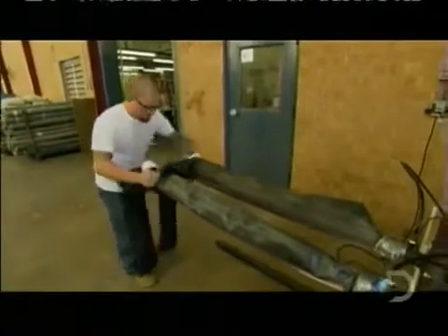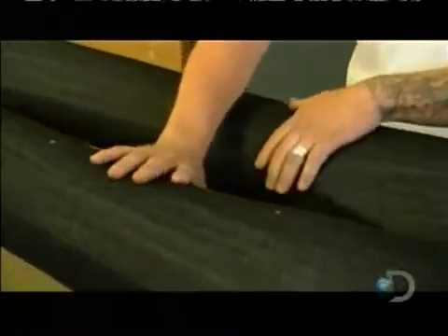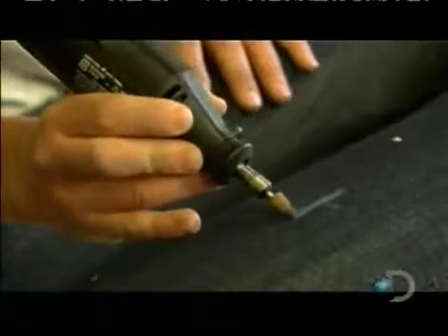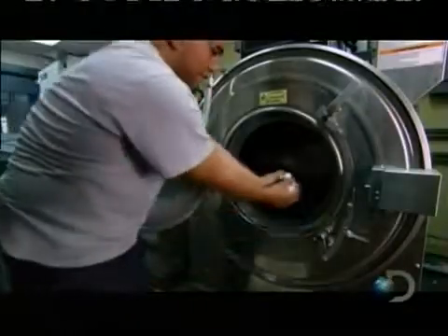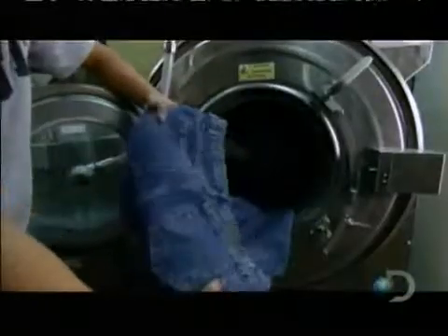Fresh off the line, the jeans look perfect — maybe a little too perfect and stiff. They need a good roughing up if they want that lived-in look. A specialist styles with sandpaper to scuff the pant legs and seat, then powers up a rotary tool to fashion some premature fraying in the fabric. The final stroke: stone washing to mimic years of wear. The jeans roll around in an industrial washer along with an equal weight of pumice stones — this volcanic rock is ideal because it's lightweight and abrasive. A protective metal lid keeps the glass door from shattering. What began as a perfect denim weave now ends as a perfectly flawed pair of blue jeans, and a perfect addition to any wardrobe.